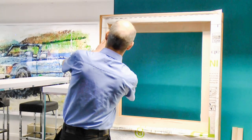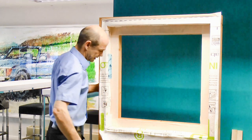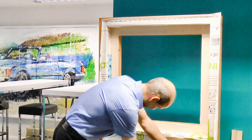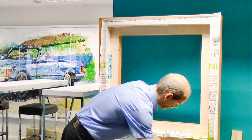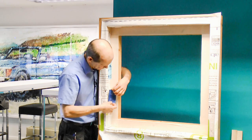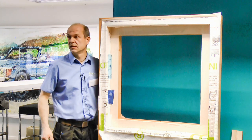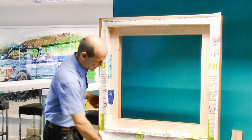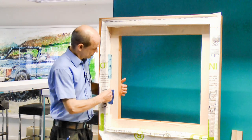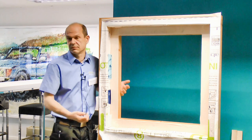If you leave the corner roundish, peel the tape off and try again — give it a good rub. If the corner isn't sharp and you just stick the tape on without pressing properly, there are gaps. The dry liner who does the gypsum board in the reveal will just push into the tape, and that's when you rip the seal. All of a sudden you get leaks that you shouldn't have.